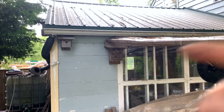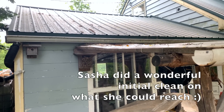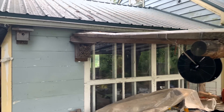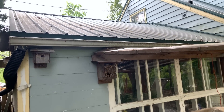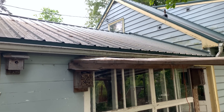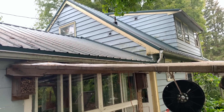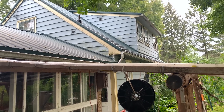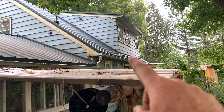If I can make the time I'll get up on a ladder and clean out all the downspout spots, get as much debris out as possible. An intense rain after a long time of no rain tends to be a flushing rain, which means it'll bring a lot of debris down, so getting in there and cleaning in advance is helpful. Planning to put on a rain jacket and clean it out mid-rain is also reasonable, because sometimes there'll be a pulse of rain, a lot gets flushed, it clogs even though you cleaned it before, and it starts overflowing. We've seen that many a time.